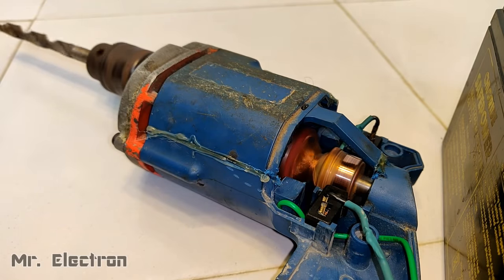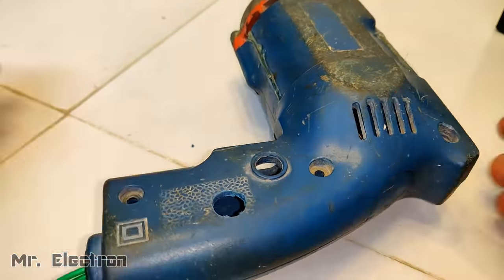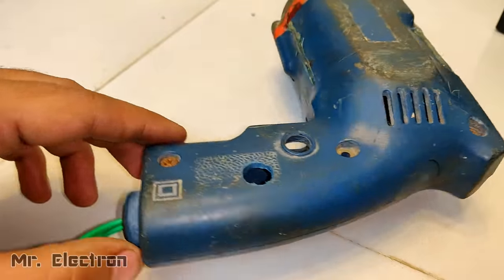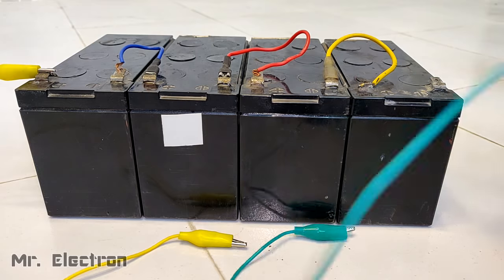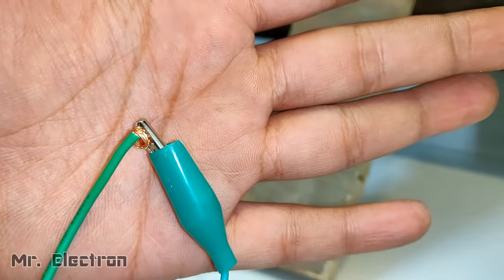good. So obviously, even though placing of the magnets makes it a permanent magnet DC motor, still the resistance value is very high, because of which it cannot run at 12 volts with a battery. Anyone who says or shows in a video that the machine can run with a 12 volts battery is showing you a fake video. Okay, connecting the 48 volts pack, connected,